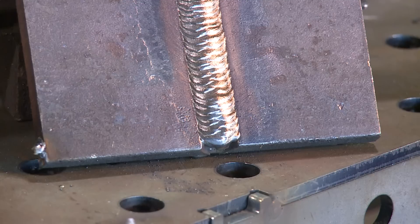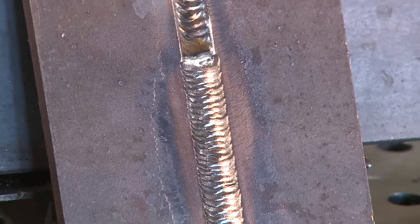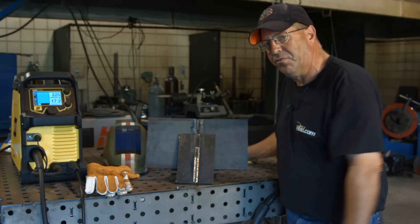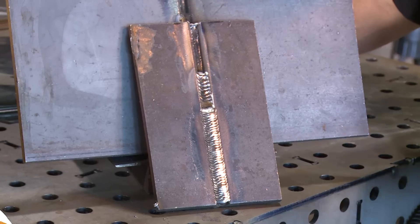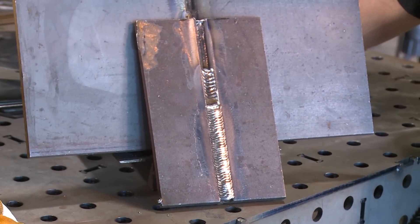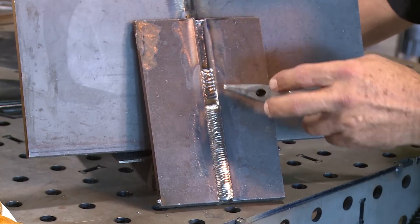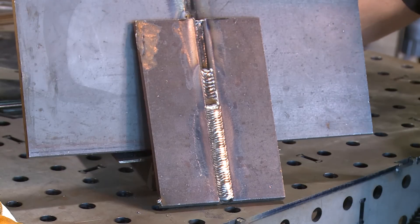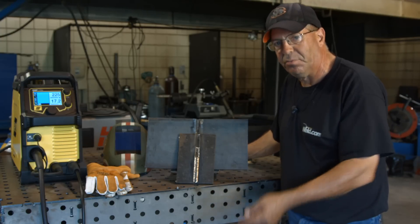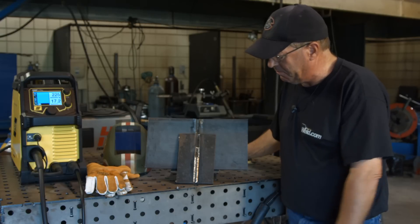This is our last pass. I went ahead and cleaned the glass and silicone deposits off. I've got a little black dust in here still. You can see the root, the fill pass, and the cap. The number one thing — I didn't want any undercut, and I wanted a nice gentle profile. I really liked the way this turned out. This is just a test to do a heavy groove on .030 wire, not something we'd normally do, but I think it ran pretty good. I liked the profile of the weld. No starts and stops, no undercut, things are pretty smooth. It's a test to see the limits — we could run some heavy stuff, run multiple passes hotter, put bigger wire in. I like the way this experiment turned out.